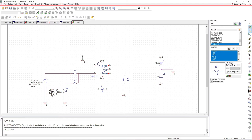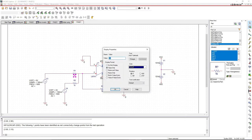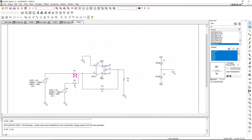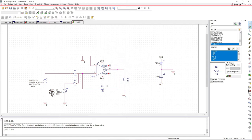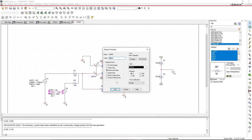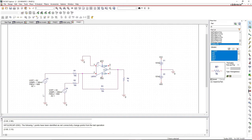The non-inverting terminal is grounded. Now this is the output — wire it up. The circuit has been completed. In this case, we're using all 10k resistors because we want a gain of one, so it will simply add both voltages. V3 and V4 will be added together without any particular gain. If you want gain, you can adjust this resistor; R2 and R3 can be adjusted accordingly. Let's set V4 to 200mV and V3 to 100mV, both at the same frequency with offset of zero. The circuit is complete.